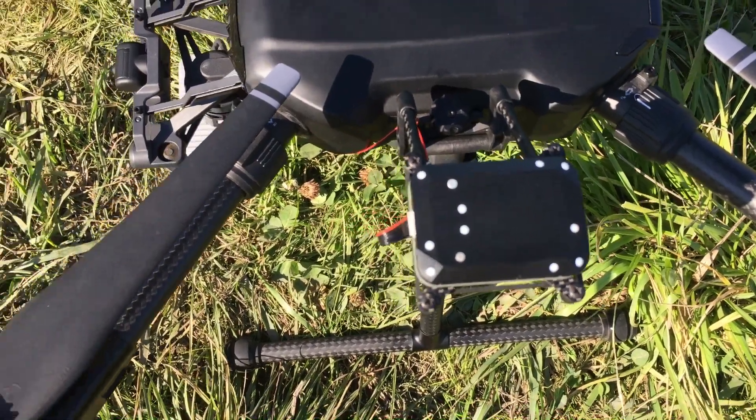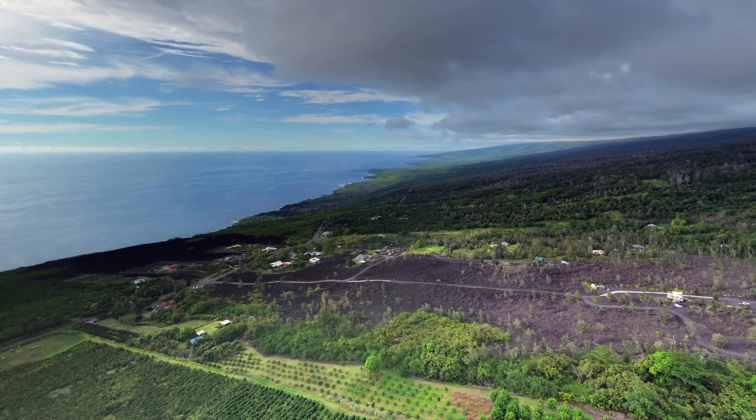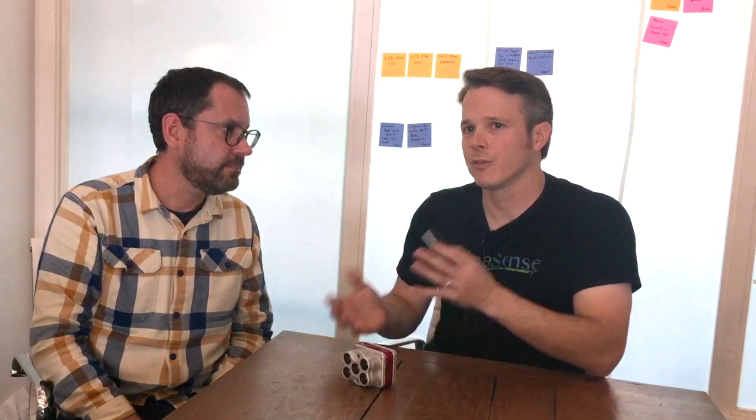You get a lot more data — not only the angle that light's coming into the sensor itself, but also a horizontal corrected irradiance, which is the irradiance on the flat ground, as well as more information like the direct and diffuse irradiance. That's another challenging piece: we have direct light, generally coming straight from the sun, and diffuse light from the blue sky or from clouds. Understanding the relative magnitude of those two factors is really important in how the data gets processed, so DLS-2 lets us estimate those factors in real time while flying and compensate for them.